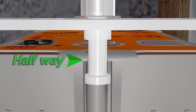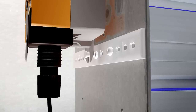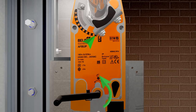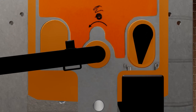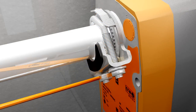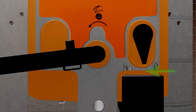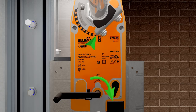The stud should be positioned approximately halfway up the U-shaped slot. Affix the anti-rotation strap to the mounting bracket. Insert the manual crank into the hexagonal slot on the face of the actuator and rotate the crank counterclockwise until the bottom edge of the universal clamp moves 5 degrees above the full fail-safe position, which is at 0 degrees. Lock the universal clamp in place by toggling the manual override lever to the locked position. Firmly tighten the V-bolt nuts using a 10mm wrench or socket. When the manual override mechanism is released, the actuator will automatically drive toward the full fail-safe position.